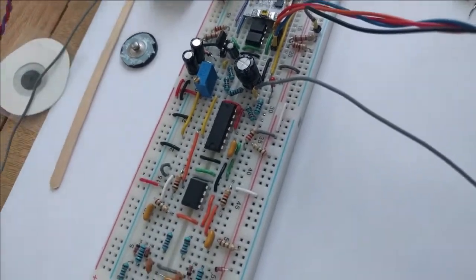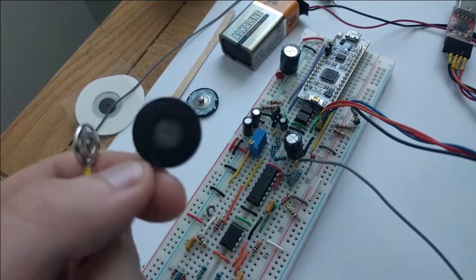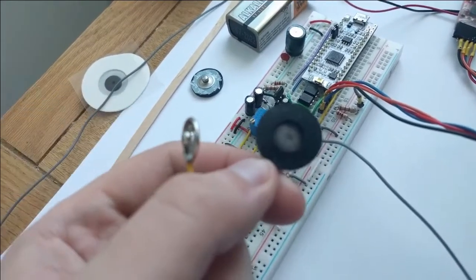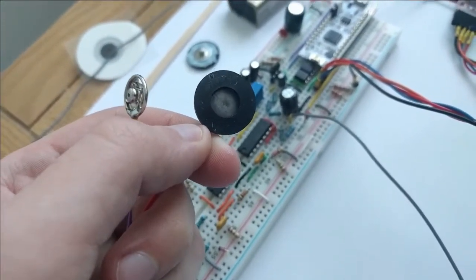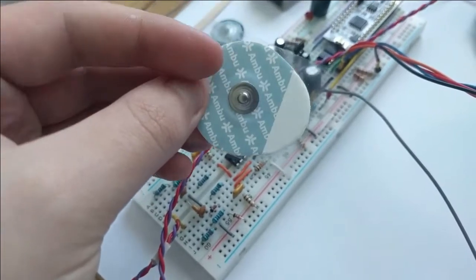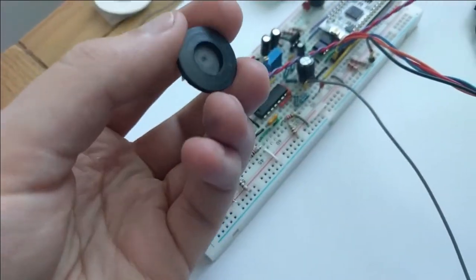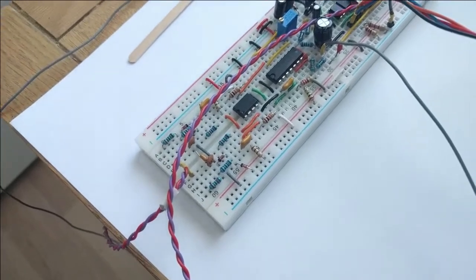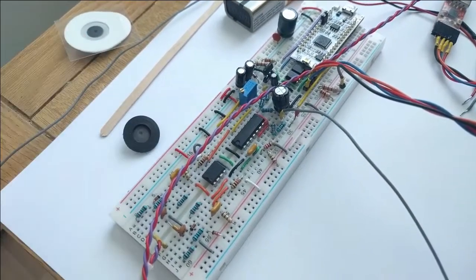So I'll show you the electrodes. These are the two measurement electrodes I'm going to be using. This is a homemade electrode made from an ECG pad. These ECG pads you can get in bulk for fairly cheap. I just cut out the center, took out the gel, and glued on a rubber shower hose washer. That now works as a reusable EEG cup, which made this way is much cheaper than buying EEG cups, which can be like tens of euro. This per electrode is less than a euro.